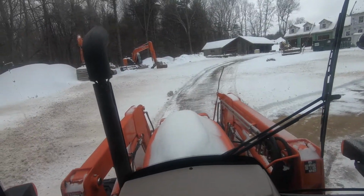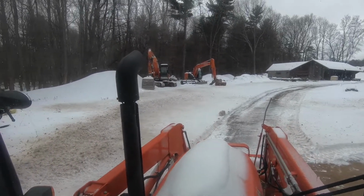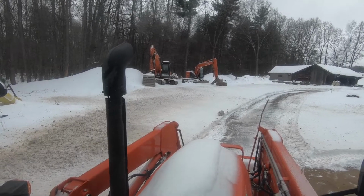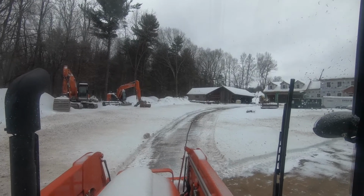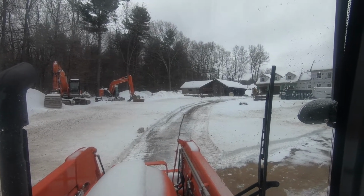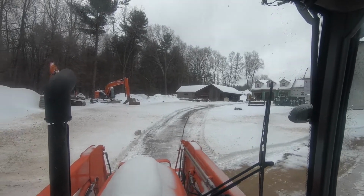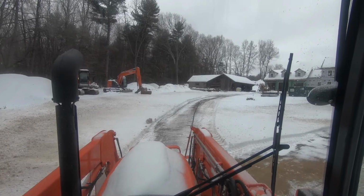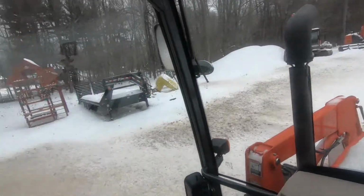All right, so kind of finished up with the snowblower for a little while, and over there where that Hitachi 135 and that 220 Hitachi are sitting, I don't know exactly what I have buried in the dirt. I don't want to take the risk of sending a 2x4 through the auger, potentially snapping a shear bolt on my PTO. It's only a quarter inch thick, 5 inch long grade A bolt that serves as the shear bolt. So again, I don't really want to make a mistake and damage the equipment. I haven't even made my first couple payments on this machine yet.